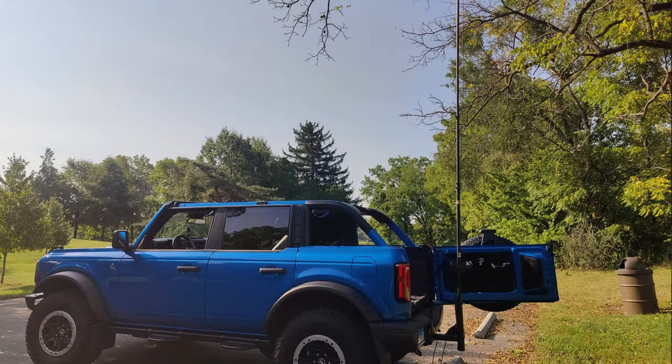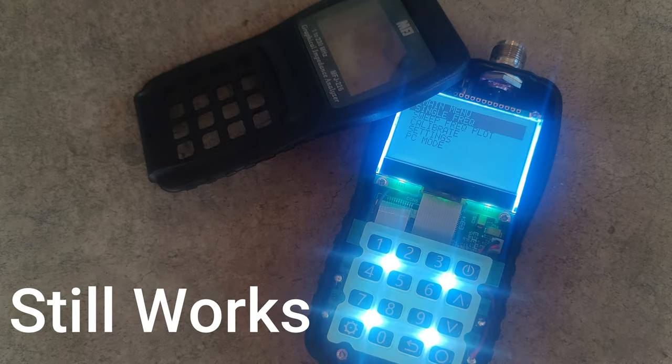But what good is this if it doesn't work? You go out, activate ham radio, and experiment — one of the reasons the bands were created for us. One thing I noticed immediately was it was very easy to match and tune this with an antenna analyzer. Using my MFJ antenna analyzer, I found a good match on 17 meters with around 96 feet of wire in a 25-foot sloper configuration. My third contact was into Spain and my fourth into Sweden — I was heard at 5/9 into Spain and 5/4 into Sweden, even though the bands were dead.